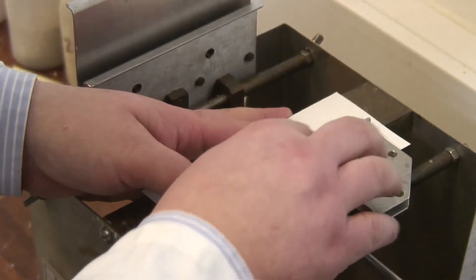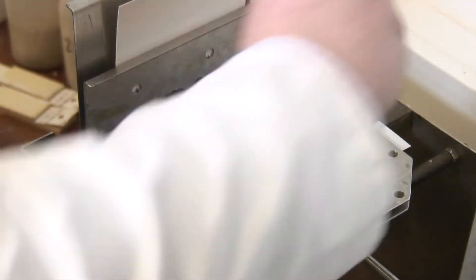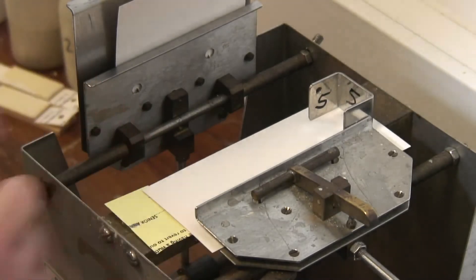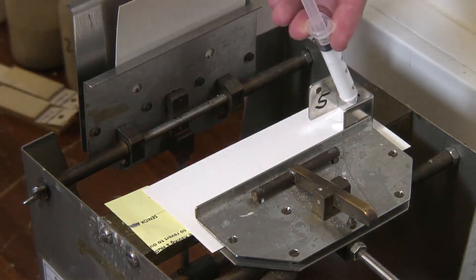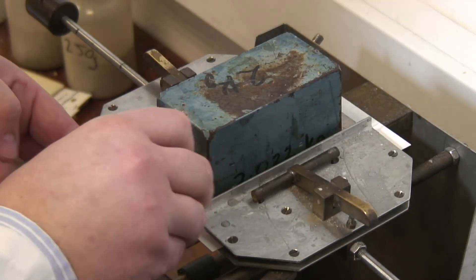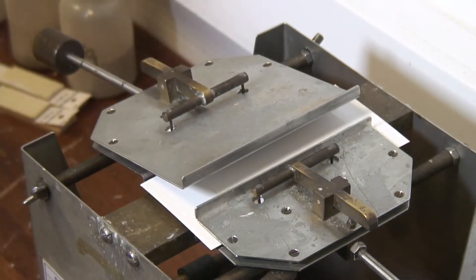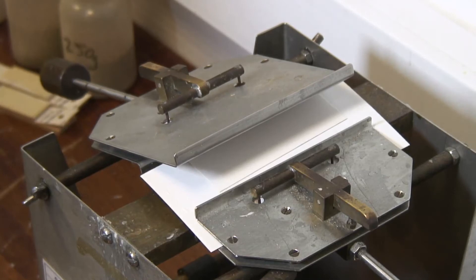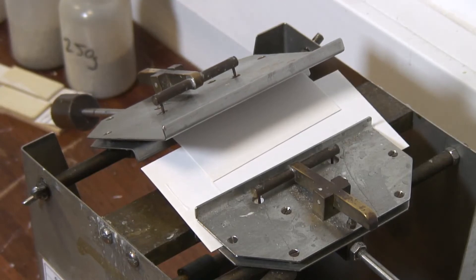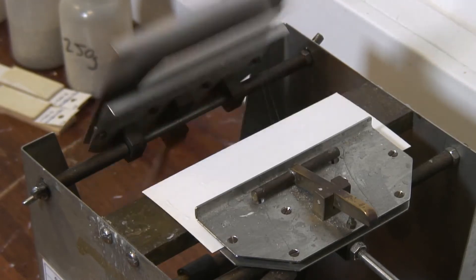That's the standard temperature at which all the adhesive experiments are conducted for the paper packaging industry. We measure the grab speed in order to determine how fast our adhesive is. That's something that gets recorded with the adhesive information from product development. We measure it on different types of card and paper so that we have an idea of the speed across a range of different substrates. This information is required because we're not only interested in what the adhesive can stick, but also how it will perform on a machine. Different machines run at different speeds and therefore the product needs to be bonded faster or slower depending on how that machine works.